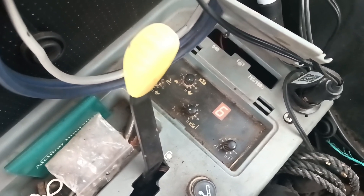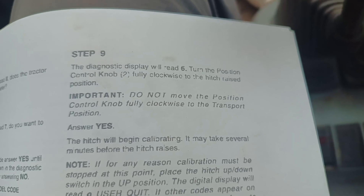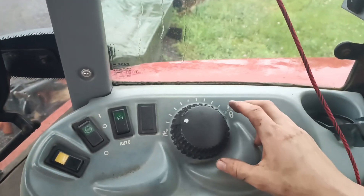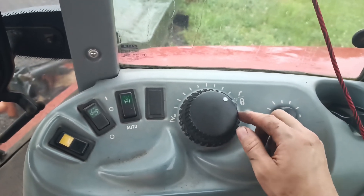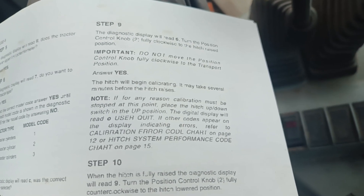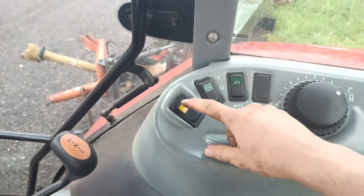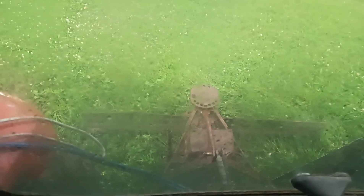We are now displaying six. Now that we are reading six, we have to turn the position control knob fully clockwise to the hitch raised position, which our control is right here. Then we will answer yes and the hitch will begin calibrating — it may take several minutes for the hitch to fully calibrate raised. We answer yes and now it will go through its process.